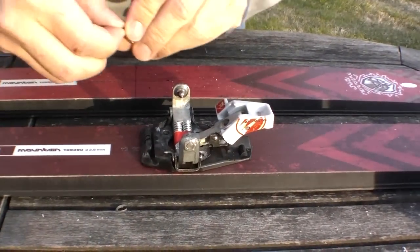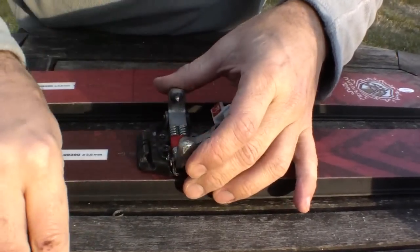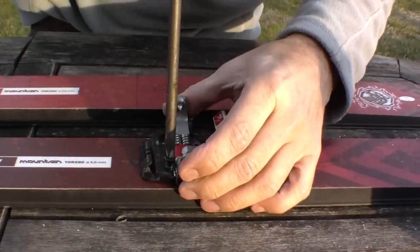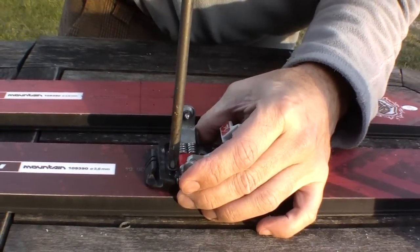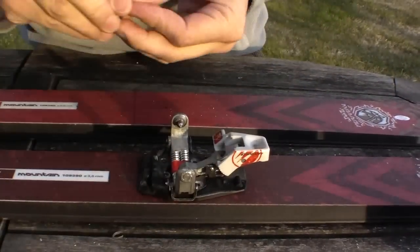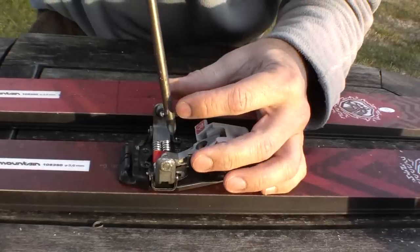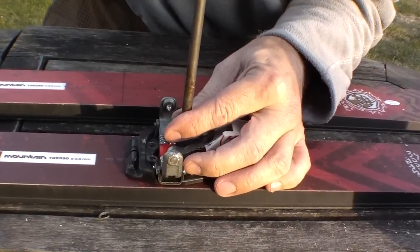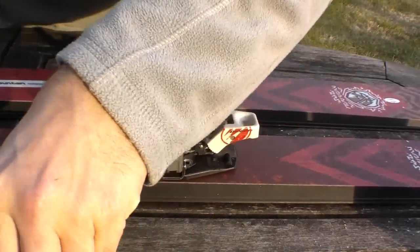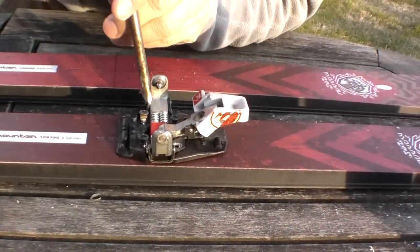Make sure the old screws are clean. So as I said, the point of the glue is to seal the holes, not to hold the screws in place. It's the top sheet that holds the screws in. It's just to provide a bit of water sealing.